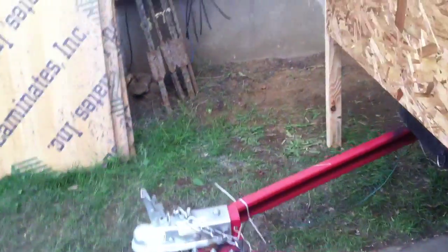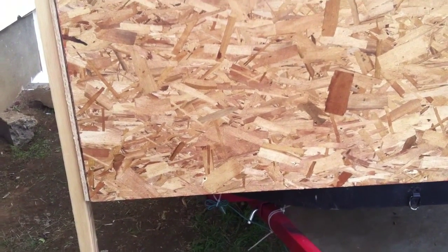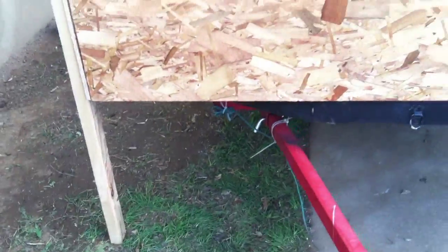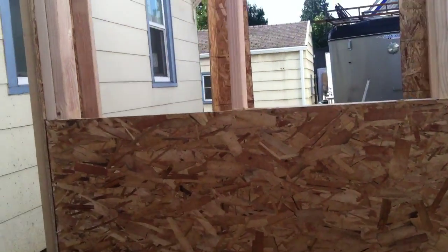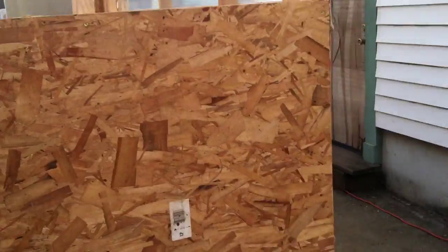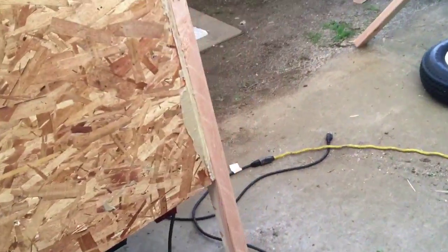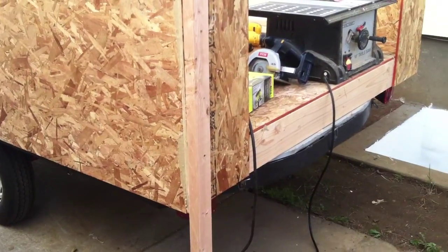Right now I simply place a couple of two-by-threes that screw into those massive corner pieces, and a few screws is what's going to keep this thing from tilting out of whack. You wouldn't use this as a full-on foundation, but it's plenty for keeping this thing from tilting as I walk around on it. With this much weight on the trailer frame — even though it's all welded steel — it was starting to flex on me. For the remainder of construction, you shouldn't have to use a jack; just muscle it, shove it, and then screw down the stand piece so we're square.